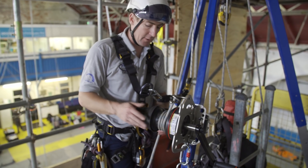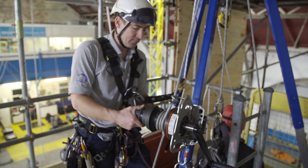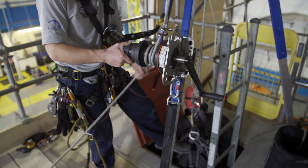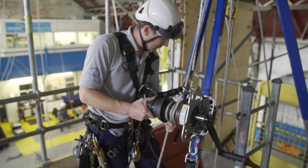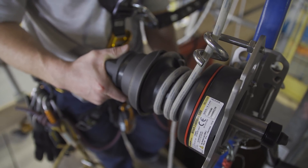To turn the Lockhead into a lowering device it's pretty easy - we just turn this handle and use the friction around the drum. You might have to feed a bit in just to get it going. Make sure he's going through his hole - it's pretty smooth, nice and controllable.